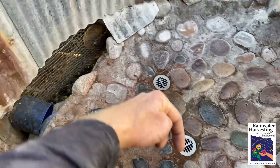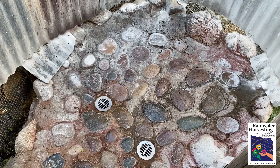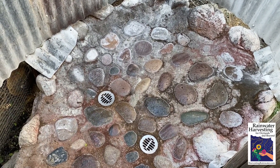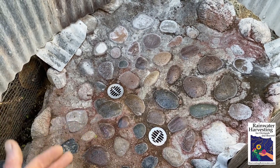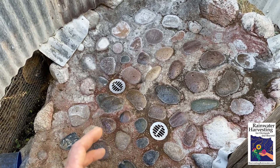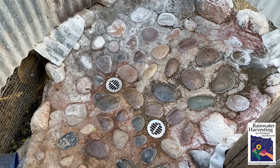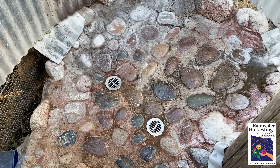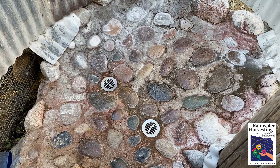This drain sends the gray water in the opposite direction. We keep the soil that receives the gray water aerobic — meaning full of oxygen — and thus it doesn't get stinky, because the water is able to quickly infiltrate into the root zone of the plants to be beneficially used. Instead of puddling, in which case it would be anaerobic, lacking oxygen, and it would stink. So this is a really good system, and I'll show you the other side in just a moment.